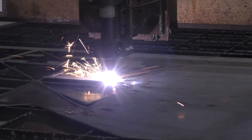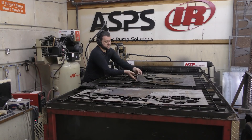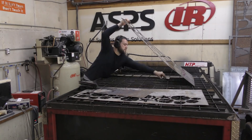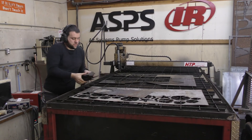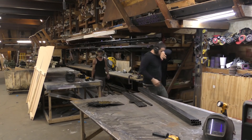Tommy was using a clamp to mark off the ends of the cuts just to make it easy. That's fine to do on long pieces, but don't do it on short pieces because you can get the piece of metal to bind between that end stop and the saw blade and kind of fling it across the shop very quickly.